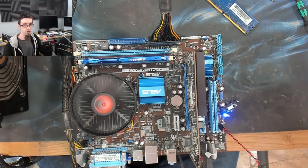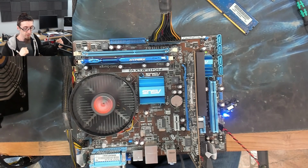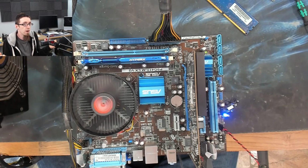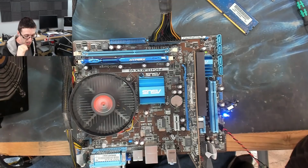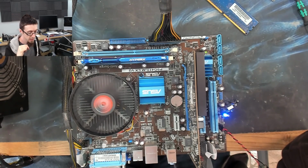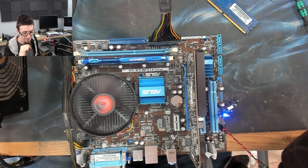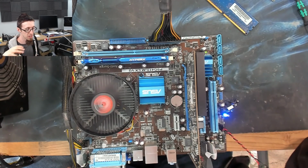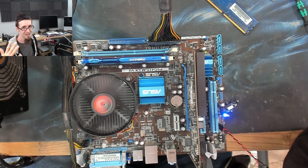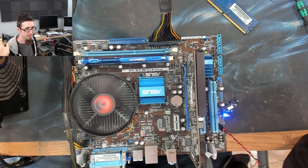And, you know, you open the computer up to do your visual inspection while it's turned on, and you see the caps and you're like, oh boy, those are really killed. But the computer is running and it's working just fine. So I really want to be certain that this board is dead before I actually do this. Because otherwise, if we recap this board and it doesn't post, and then I reflash the BIOS chip and that fixes it, was it really the caps, you know?